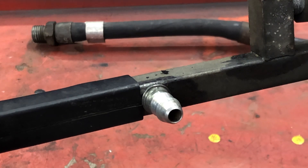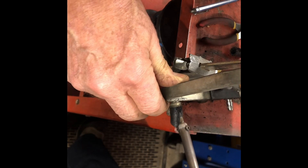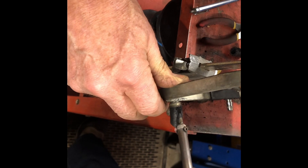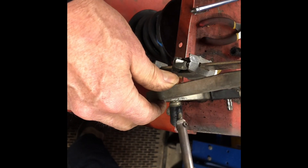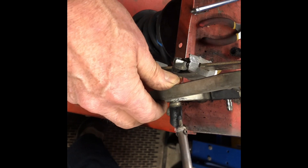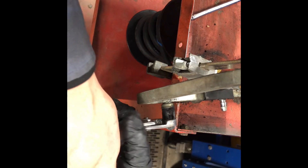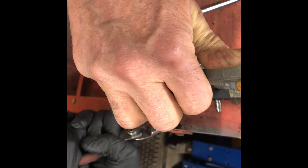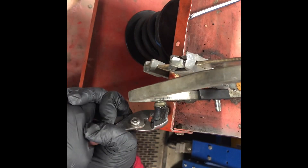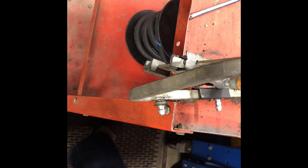I'll be using this from now on — I think this is a fabulous way to take these off. Can you stabilize it for me? There we go. It's smoking — that's what we're looking for, a little smoke. Come in a little bit closer to the ring just to get it at the very end. Position the pliers right there, pinch them shut and rotate. You can see the fibers, but it's right at the cap end — it's still stuck. There you go, look at that — perfect, you did it!